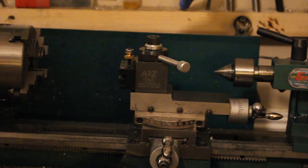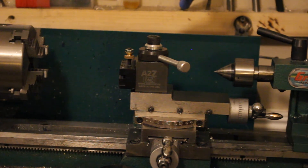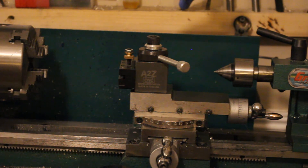Why do I care about quick change? A standard tool post that comes with any lathe, you've got to take a wrench and put every bit in and out, re-center it on the work piece, and then use it. When you want to do a different cut — like left facing, right facing, cutting a groove, or a cut-off — every time you do something you've got to reinsert and re-center the tool. That process can take 15 to 20 minutes for every tool. It'll drive you mad.